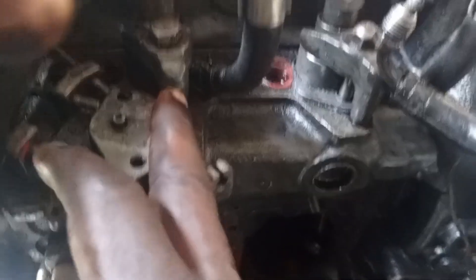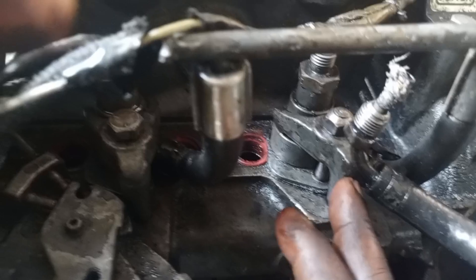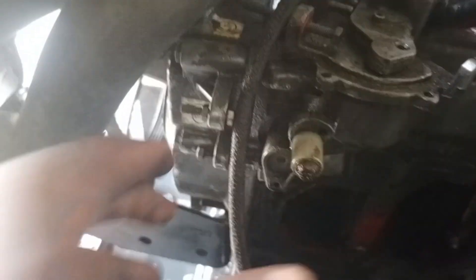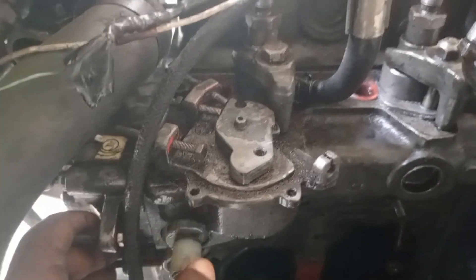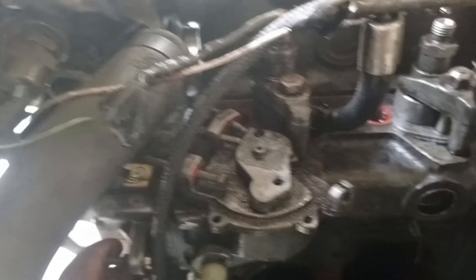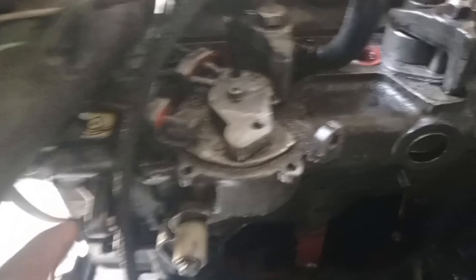The third problem I'm going to mention is the injection pump. You can see this engine has two injection pumps — this is the first one and this is the second. This injection pump has a setting; you need to ensure the injection pump seats very well. This is the control — this is where you are going to know. Listen for the sound. If you don't hear that click sound, that means the injection pump did not seat the right way. Ensure that the injection pump is set very well.